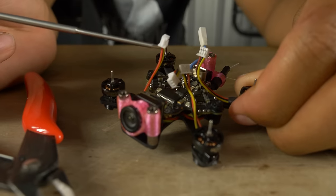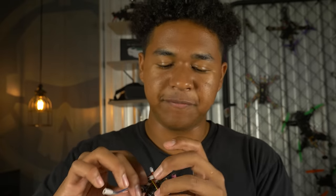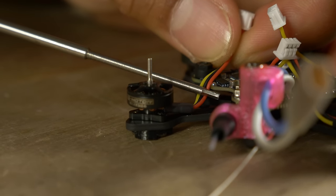The motors come with connectors, but I'm against using plugs for motors on these drones because direct soldering has a much better connection and provides more performance. I designed this drone for maximum indoor freestyle performance, so even though it's harder to build, the payoff is worth it. Direct soldering means more metal-to-metal contact, which lets you pull more amps and spin the motors faster — same reason we use the BT 2.0 over the PH 2.0 connector that came with the Flywoo.